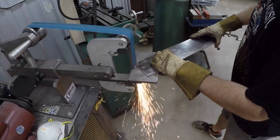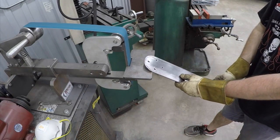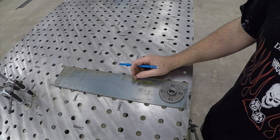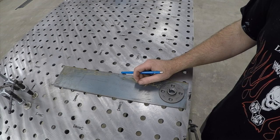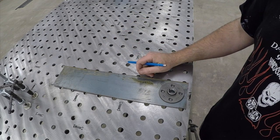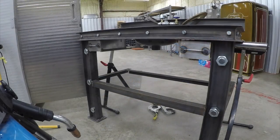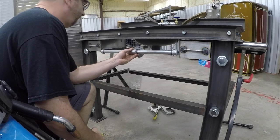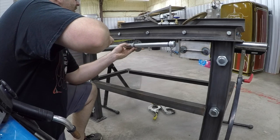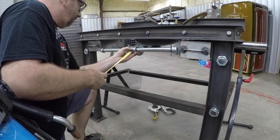One of the points I wanted to make: when you're making a bracket, you want to do all of your hole drilling, putting slots in it — anything where you've got to fixture it in some way — before you cut it to its final length and certainly before you start bending any part of it. Because once you bend it, you've limited your ability to get it clamped and drill it, or the reach of the drill may not be able to pass through the bend. So once we get the holes done, we want to take measurements to figure out exactly how we want to get this mounted, how long the bracket needs to be, and where the bend needs to be — just holding it up, mocking it up, using the tape measure.